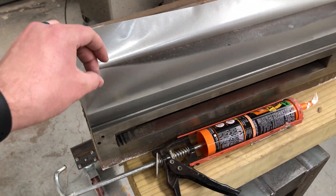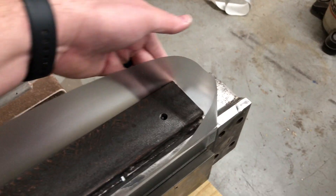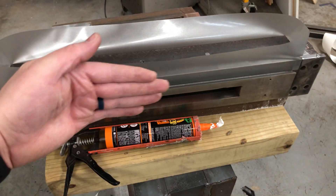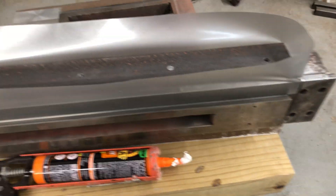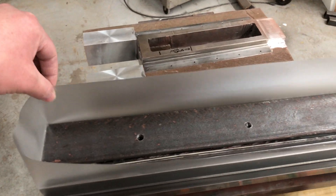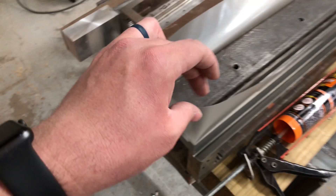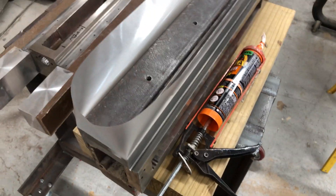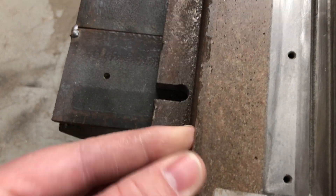This doesn't super matter for me because I just want it to be heavy and absorb vibrations. The epoxy is really not that hard to remove anyway - a file or sandpaper takes it off easily. I'm basically going to put support boards to support this, then tape the vinyl to the boards to make it taut so it comes out pretty smooth. I'm casting one side at a time because I don't want to build a giant complex mold. It does take longer this way since you're doing multiple days of curing - this stuff takes at least 24 hours.